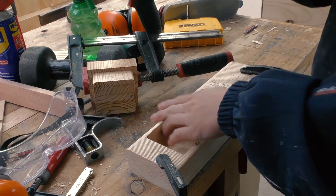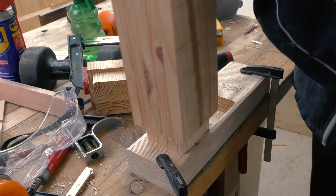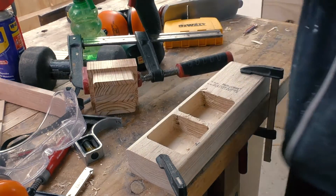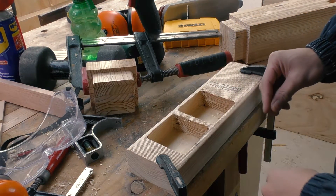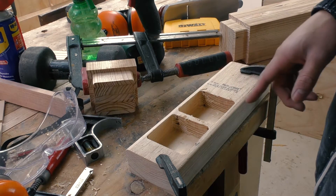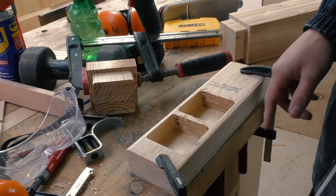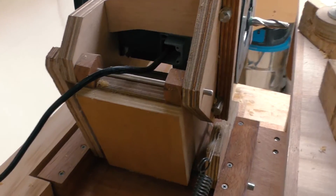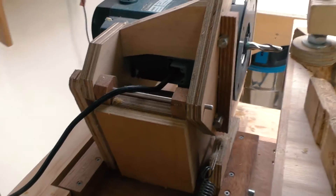Yeah, and with a pop as well. This same thing actually happens for test two and test one if I put them together. So I guess the tape kind of makes a difference, but if I actually need tape around a bearing to make the mortise and tenons fit, then there's definitely something wrong with the pantograph. I reckon my main problem would be twist in links, because I didn't jig it up when gluing the links together to ensure that the shafts are in one plane.